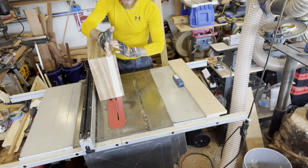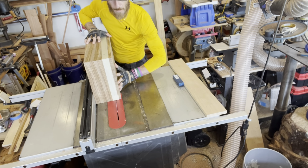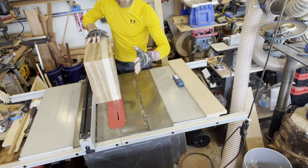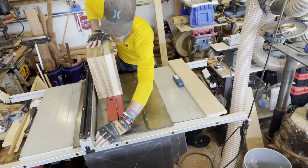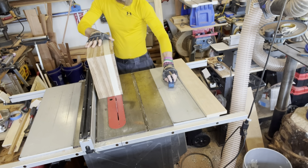The idea is we get as close to cutting it off, but still keeping the lid actually attached. Because if you cut out all the material, by the time you get to the last two cuts, you're gonna push in and be binding the blade. You don't wanna do that. Your top will be all cockeyed, and it won't be a true edge to make the box look the way that it should. Kick on some dust collection here.